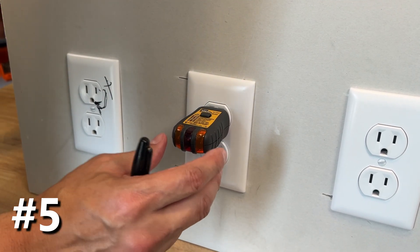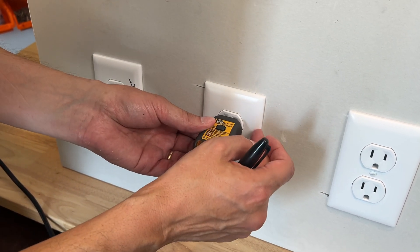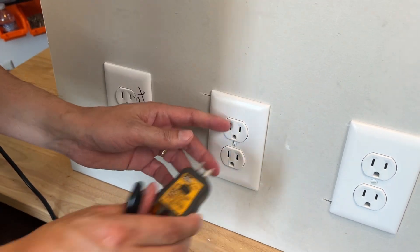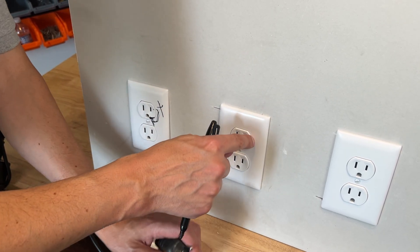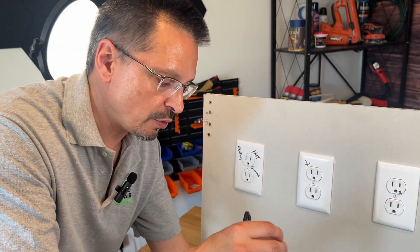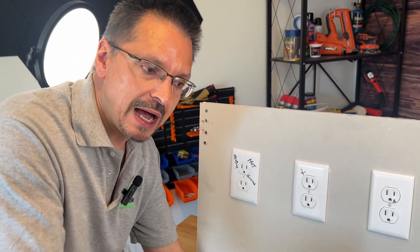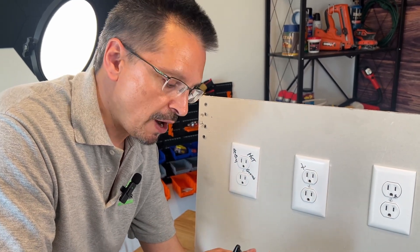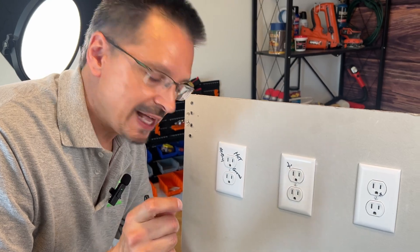Apparently this one is a completely dead outlet — all lamps off means open hot. That means the hot wire has simply come disconnected. When you pull this to diagnose the dead outlet, it could be a problem in this outlet, but it could also be in an outlet somewhere else in the room or an adjacent room that's feeding this outlet. This dead outlet might be downstream of another outlet that lost power, so you have to trace backwards and find the loose, open hot connection.